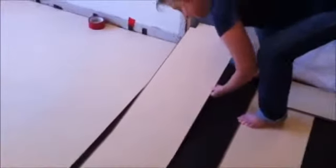Now, here's the hard part. You have to angle up this section and then sort of wedge it into place, but then you have to smooth it out and fit it in sections. Okay, this needs to go that direction. Now, what we didn't show was picking this entire run up at about a 20-degree angle, and wedging it in. The way it works best, we found, is we start from one end, usually the right, and wedge it in so that you don't see a gap, and then you work with it slat by slat all the way down until you don't see a gap down the entire course. And then you have to be very careful at tapping it into place.